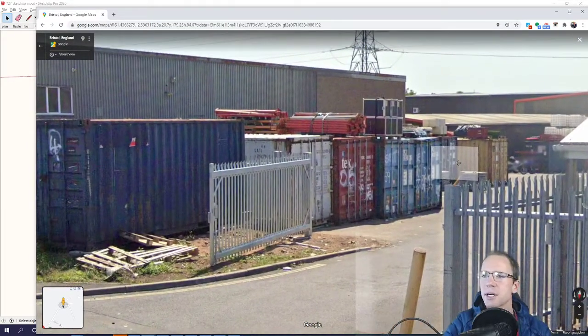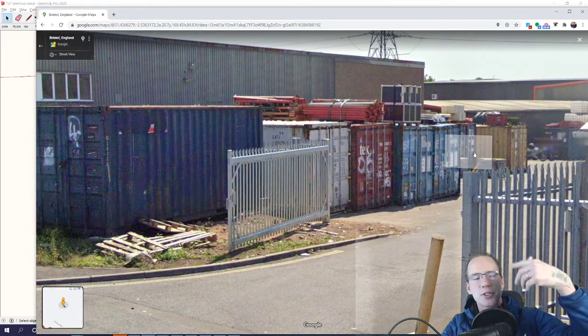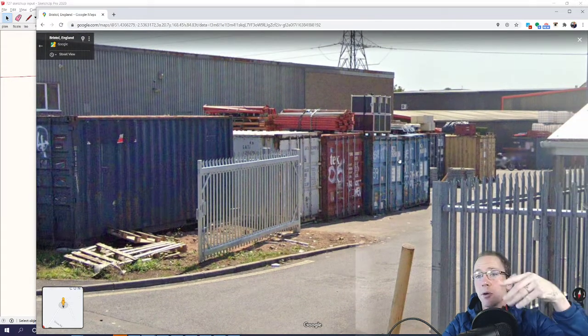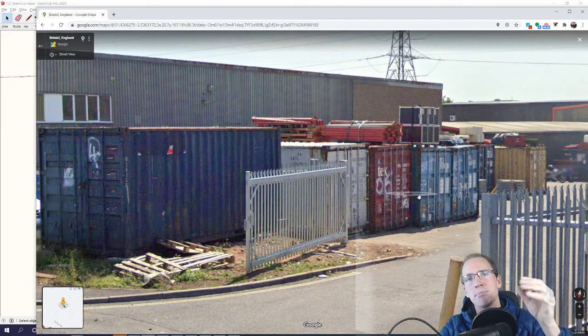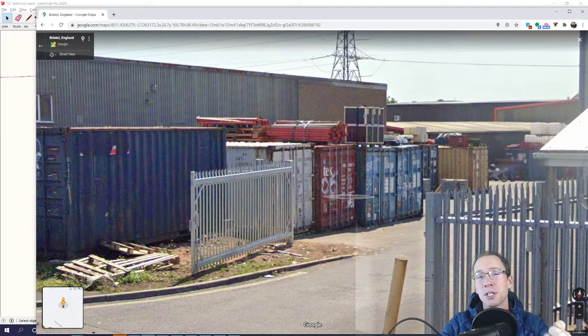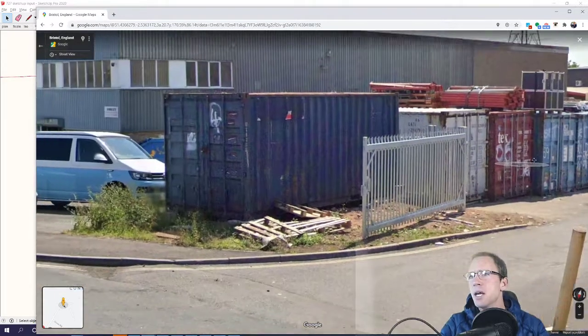Next thing is the way the containers look — we need to spray them a light blue colour. The idea is they're going to look like clouds. Once they're blue as a base, we can get our artist friend Jody Thomas to do the cloud work, or he might train our staff in how to do it. We need to establish what is the best paint, buy some samples, test it, let it weather and see if it peels off. I'm mindful it might not be as simple as spraying on top of metal — do we need to shot blast, do we prime it, or is there a paint we can put straight on that will really adhere to those shipping containers?